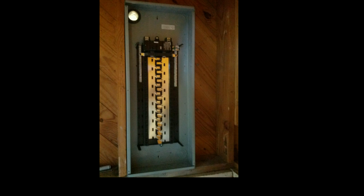Here is my space prepped and almost ready to accept the new breaker panel. The backing basically consists of three two-by-fours stood up on end, screwed together and screwed to the wall, and then I put a sheet of three-quarter or quarter-inch plywood over the top of that to give it a nice flat surface. Here is the panel put up to that with some screws to hold it in place. Before mounting, a hole was cut in the upper left-hand corner of the box to accept the two-inch rigid conduit where the feeder wires are going to come in.